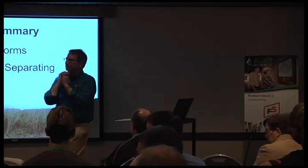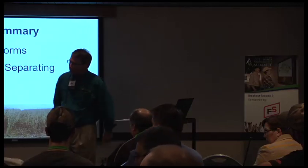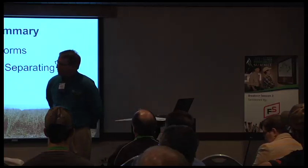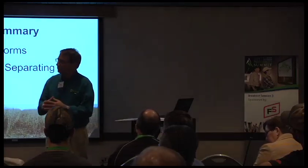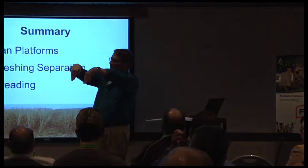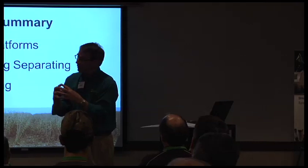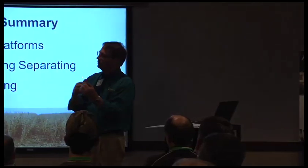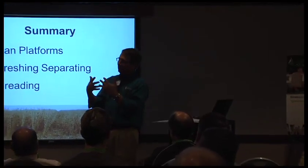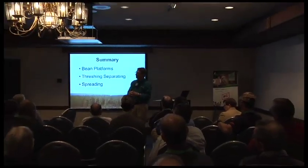How about the knife rolls for chopping Bt corn — any trouble with down corn feeding in? We have what's called a revolving entry window with different length flutes on the stalk roll. When the short flutes come together, they create a little feeding chamber that allows the stalk to come in. When we went to ten flutes in the circle — if I can get a hold of that stalk with ten flutes, I can just reel it on in. When testing with Deere and Case with four or six flutes, you could actually cut them off and they'd fall over. But with ten flutes, it really helped in down corn.